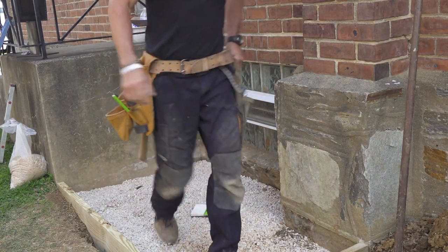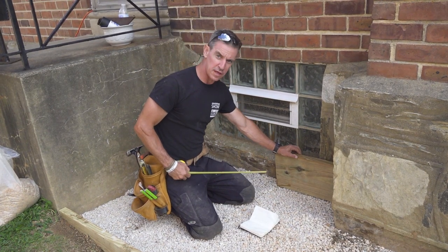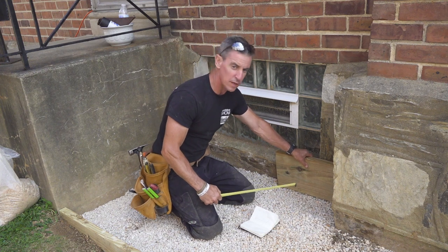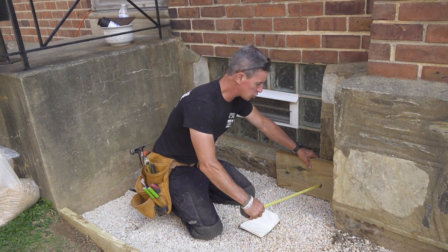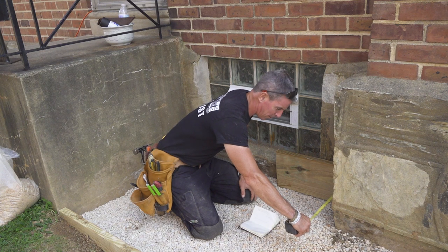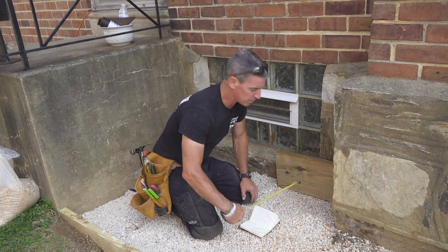Trick time: the reason for this block of wood is because I have to account for its thickness in my next measurement around the corner. I could figure it out mathematically, but it's easier to measure to and from real things than to measure to air and do math. There's something you just can't see — I would have gotten this wrong otherwise.